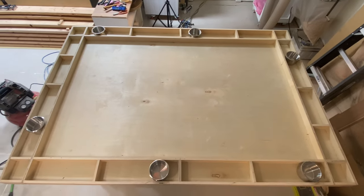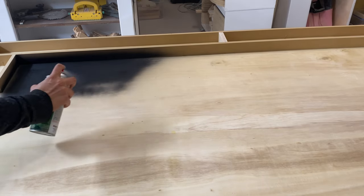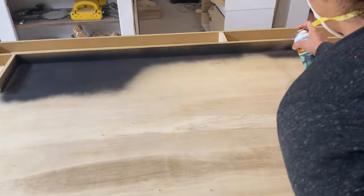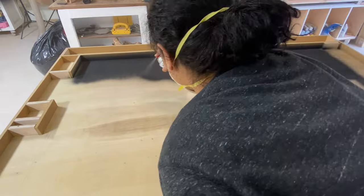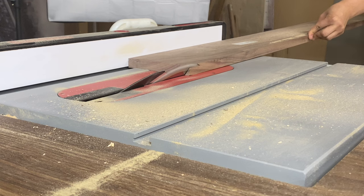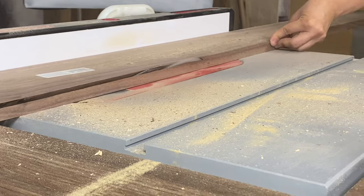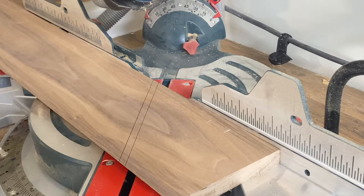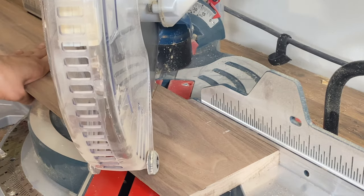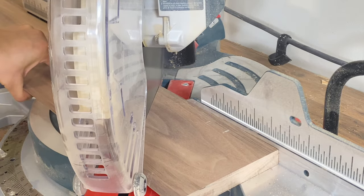The cup holder is in the wrong place here but that's just to show the idea. I painted the middle section black because even though there would be a black mat sitting inside, the mat would have a half-inch clearance around it, and it looks more professional. I only gave one coat since black can get very dusty. For the fun part, I wanted to add a cool bevel on the edges, so I set my blade to 30 degrees and cut one edge off the walnut, then cut the edges to the right size at a 45-degree angle, using clamps to make sure everything lined up perfectly.